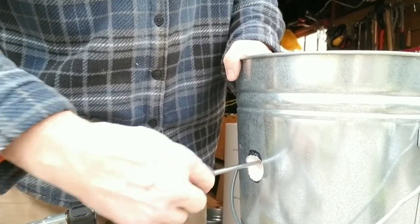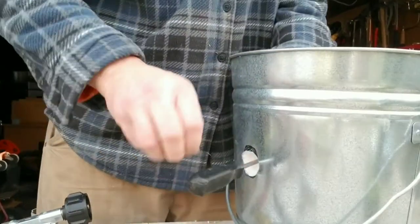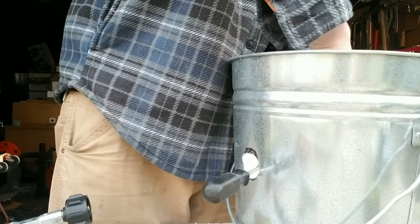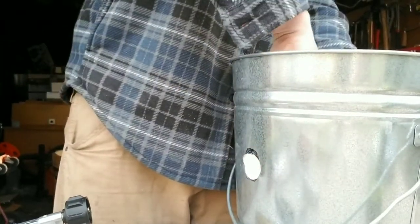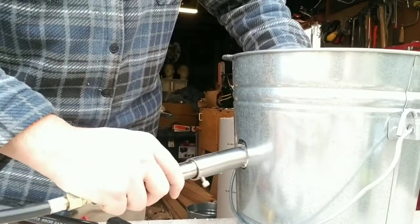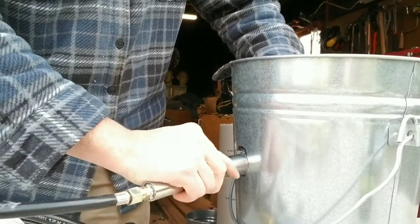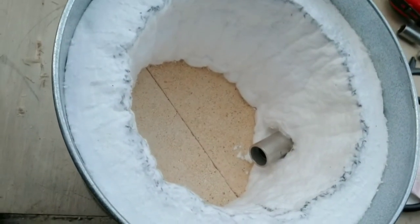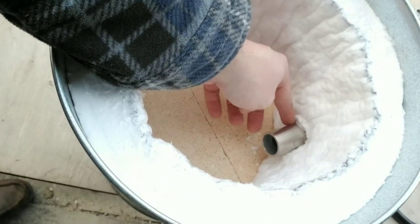This fabric really kind of moves out of the way quite a bit. I'm just kind of carving away at it. We just want to give the burner a chance to be able to go all the way up. I just kept digging at it and now I can kind of work this slowly into the furnace and just let the fabric kind of move around it, and it acts as a heat gasket so this hot air can't just blow out of here.